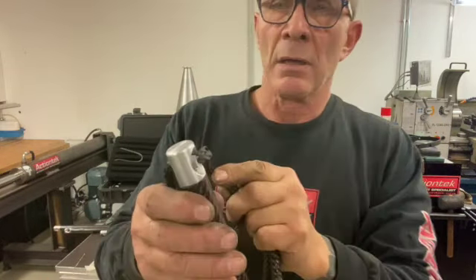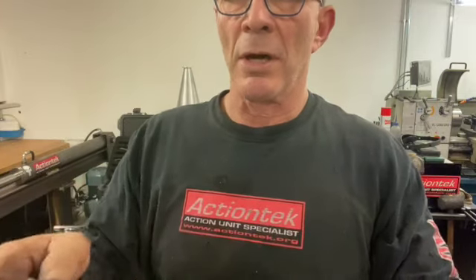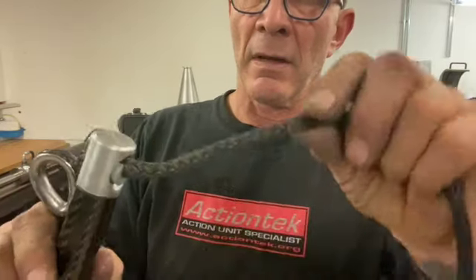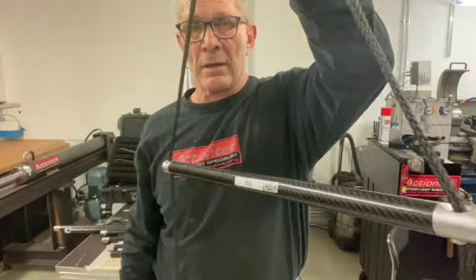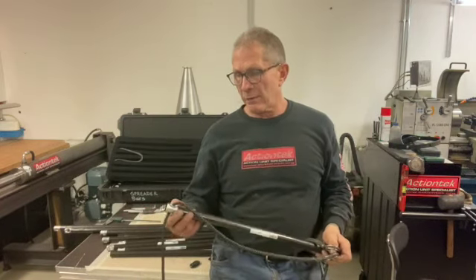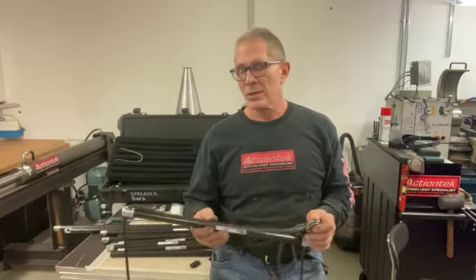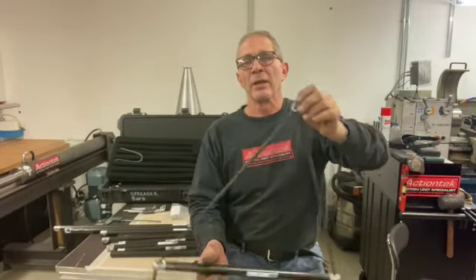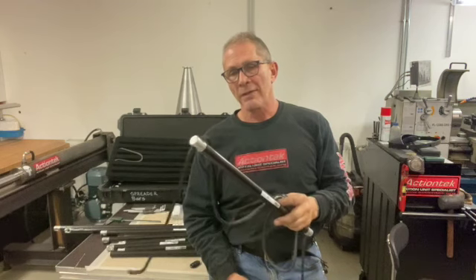There are instances when you can't, when you have to use the bar. I'll run a slip ring down on these — a friction ring — and pull from the triangle if needed. When this is under load, you don't pull these out because of the compression; you're never going to pull harder than the weight is pushing in. You'll get your best results pulling and manipulating — puppeteering people from themselves. The rubber is through the hole, the grommet is fixed in the hole, crimped on the rope itself. They pull up pretty tight and now it's fixed in there. Easy to change, easy to deal with — pretty simple, and super light. A pair of ends is 100 grams, a meter of bar is 350-400 grams, so a half-meter bar is about 175 grams — making this 275 grams total plus rope weight. Virtually weightless.